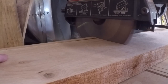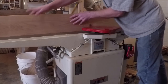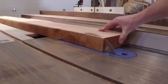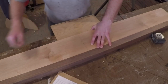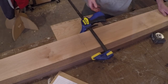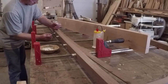While the frame was drying I moved on to making the bed rail to go underneath the headboard. This piece is what the mattress supports will be attached to. Since the support would be hidden under the mattress I used alder as a cheaper wood. Once I had the piece cut to length, milled flat, and squared at the jointer I cut it to final width at the table saw. I centered the rail on the bottom of the frame, temporarily clamped it in place, marked out some dominoes to add strength and keep the pieces aligned during glue-up, then glued in the dominoes and spread some glue on the rail and clamped it up.